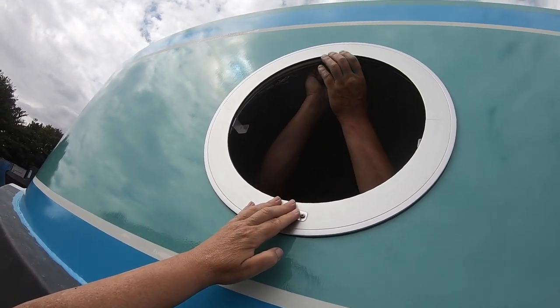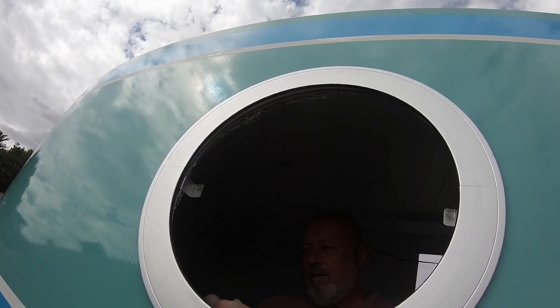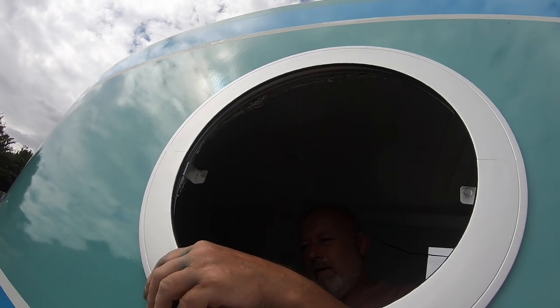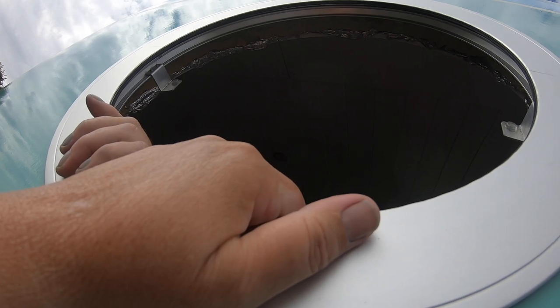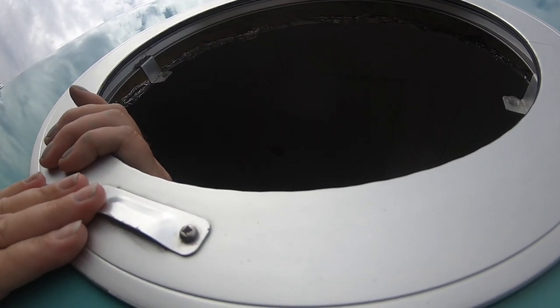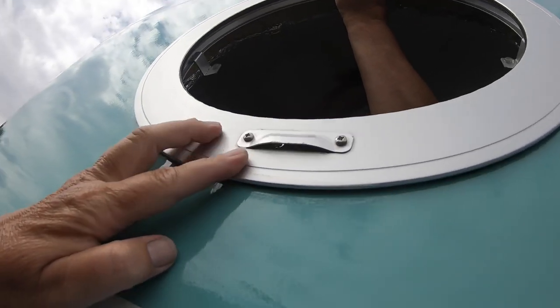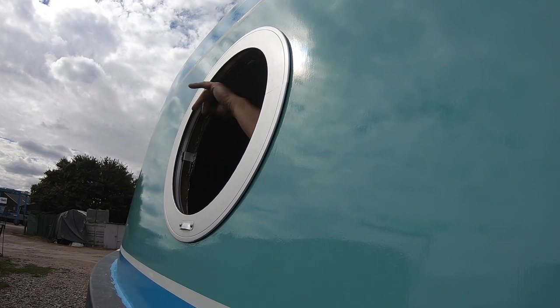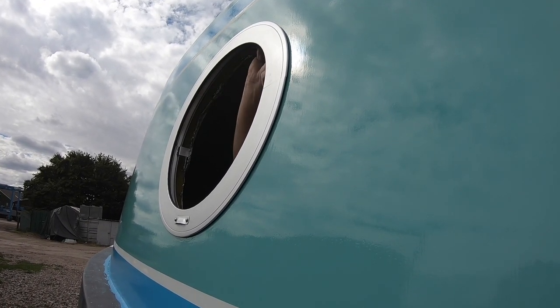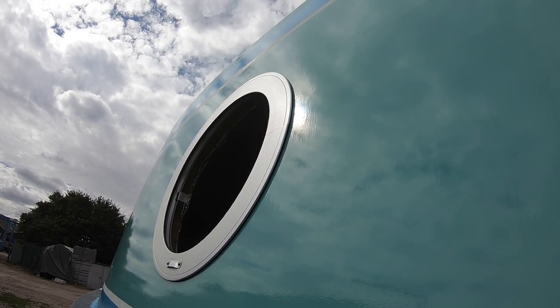Paint's dried just in time, really. We've timed it right because it's forecast quite heavy rain tonight, so getting these windows in was quite urgent. Simple as, these windows, aren't they, from Coldwells? They just push in and then you put little clips in and screw the clips up tighter and work your way around until it gets really tight. Simple. And we've never had a problem with any leaks.